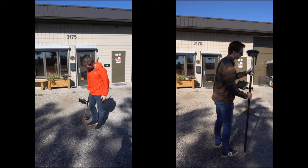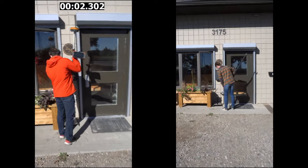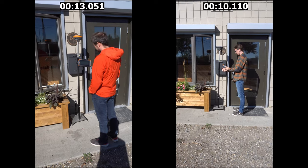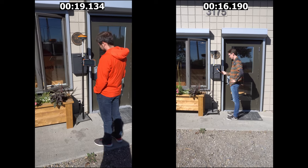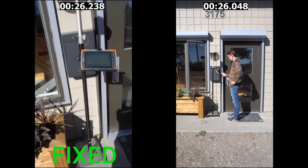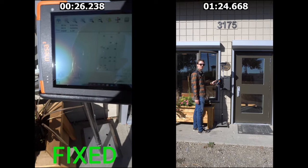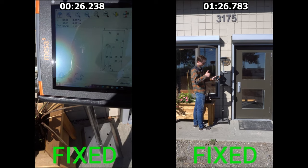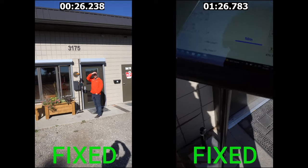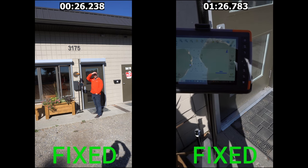In our second test we again dumped the antenna to lose the fix, then walked it into the building. The idea is to see how well it does up against some buildings — right in front of our office here in Calgary, blocking out the western portion of the sky, with an eave blocking directly above the receiver. We really only have the eastern sky to work with. The Hemisphere fixed in 26 seconds with good tight residuals, while the Leica GS18 came in a full minute later before getting that fixed solution — also with nice tight residuals, but not nearly as quick as the Hemisphere in this multi-path environment.